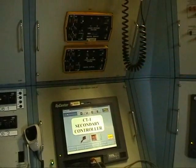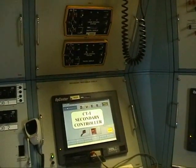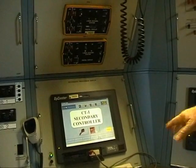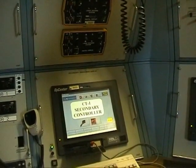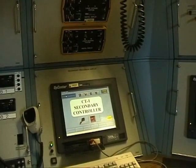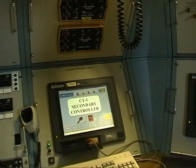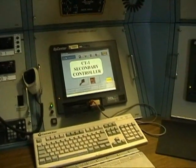They'll set the counts in here. On the bottom of the MLP, there's actually some laser receivers. We'll set a transmitter up in the bay. As we start in, they'll pick up that signal and bring it around. You'll see in the cab when we get there — there's a red line. They'll line the lines up, and once they get lined up and we come in and come to a stop, we're normally within one-eighth of an inch or less, perfectly square in the building.